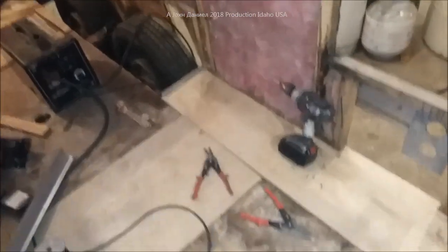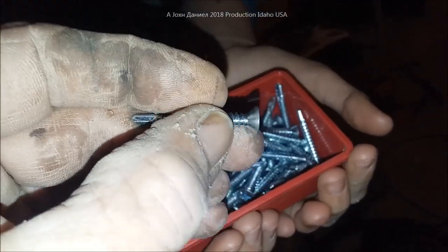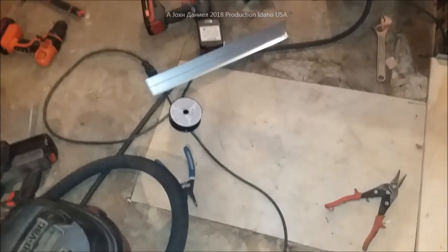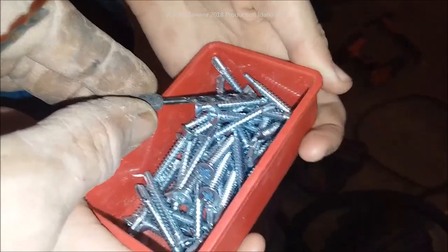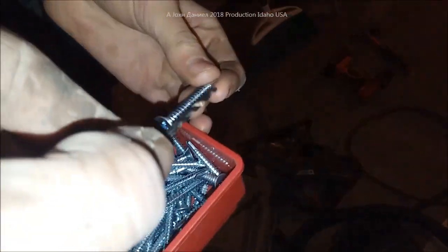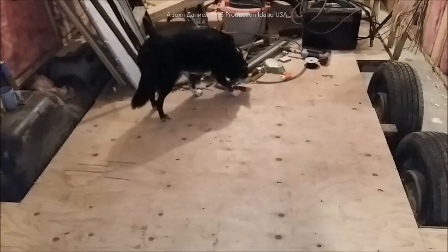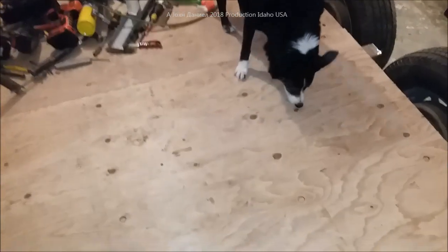Our next step is shooting the screws down. The screws we're using are these self-tapping Phillips drive screws with a slight tapered head — they go into the metal and hold extremely well. These are inch-and-three-eighths. We use a starter bit where we drill a hole first. The starter bit is two-thirds of the diameter of the screw — it might look the same but it's two-thirds — and that allows the starter bit to get a good bite, sink, and pull itself down into the wood a little bit, making a very tight fit. All right guys, the repair wood is down, and over here where Emma's at is a new piece we haven't put down yet.